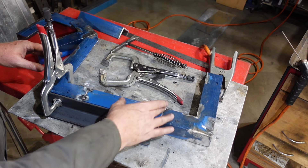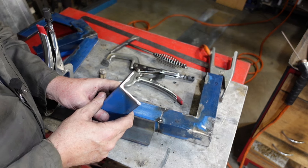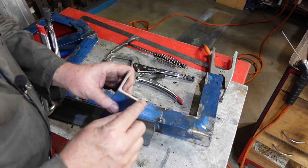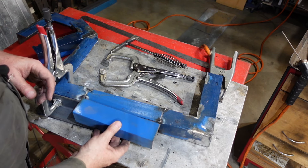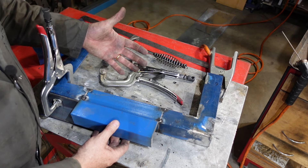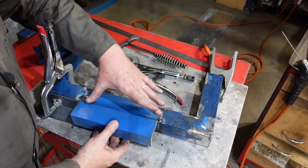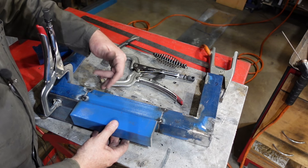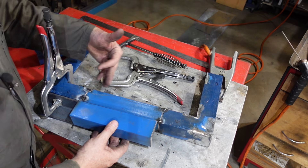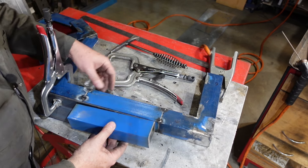I'll tack to get it in the right position, and once I'm happy with that I'll weld fully around. This material is 5 mm thick — rule of thumb is anything over 3 millimetres you're not going to get full penetration, so I've put a bit of a bevel on here. That'll give me a bit better penetration, and it's going to be dressed flush as well. When cutting pieces of material for jobs like this, rather than cutting one of my longer pieces, the rule I use is to find the shortest piece that will give me the pieces I want — but juggling that if I need three pieces and can only get two and a half out of a shorter piece.